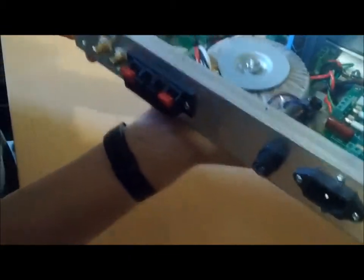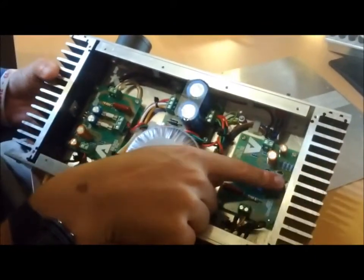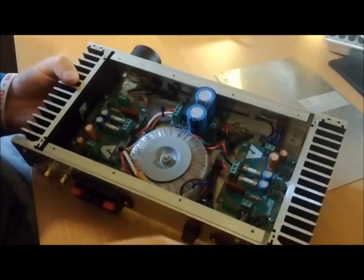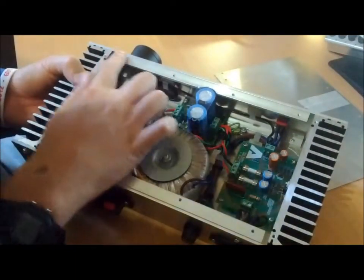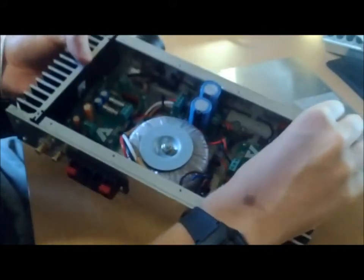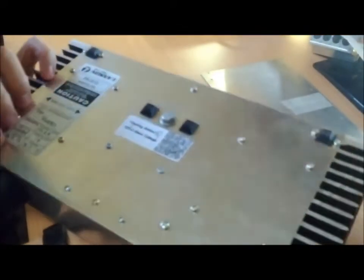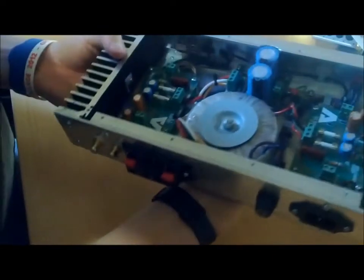The case probably took the most amount of actual work, because there's just a lot of drilling and tapping holes. For each heatsink alone there's nine holes in each. Then there's four rails — they're just aluminium angle, I think it's 10 by 10 by 3 — one in each corner, and they each have two holes in the front and four holes across the top, though the bottom ones only have three. I changed my mind between doing the bottom and the top one. The bottom's also a bit thicker than the aluminium, but that's just the way it worked out.